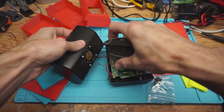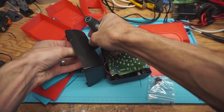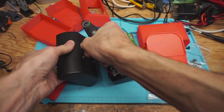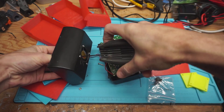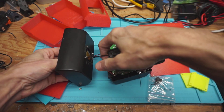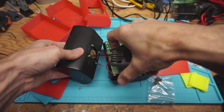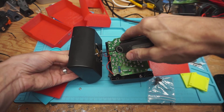In general, that's a bad idea. In this case it's a particularly bad idea because this UV is probably running at about 400 to 405 nanometers and your eyes don't have much of a natural defense against that. Anytime you're working with any kind of UV, you want to have the proper safety equipment on — usually completely UV-blocking glasses for whatever band you're working in. It's very important. It'll save your eyesight, and those glasses don't cost much relative to whatever you're working on.